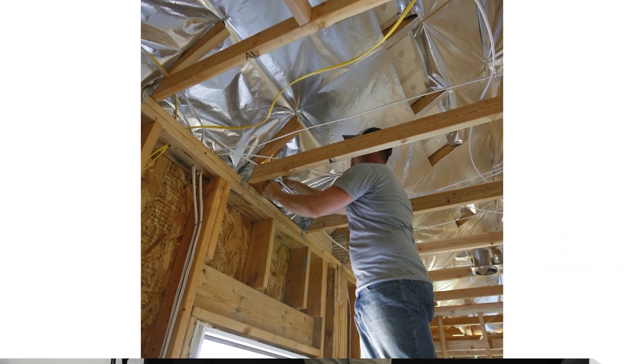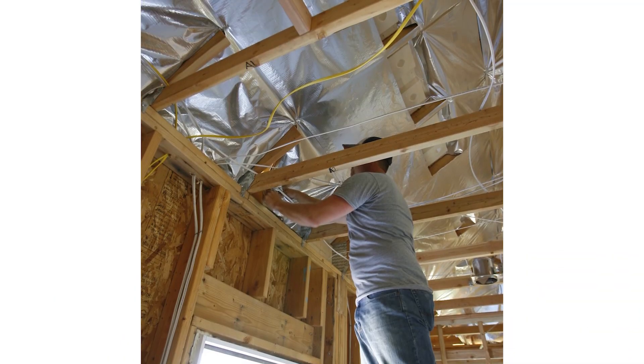Why? Because the outside jacket of the flex is getting cooler, since it's not picking up all that heat from the attic. So that's a tradeoff — it's always a tradeoff. If you're going to go into an attic, we talked about radiant barrier. If somebody adds a radiant barrier and didn't have one before, what starts to happen to a lot of ductwork? It starts to sweat.